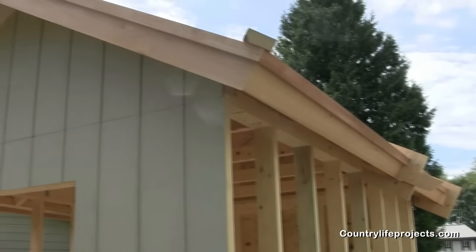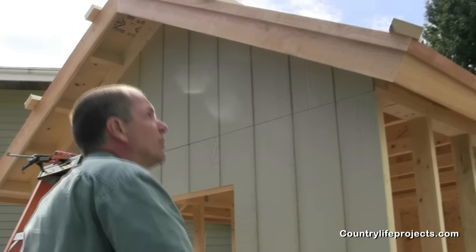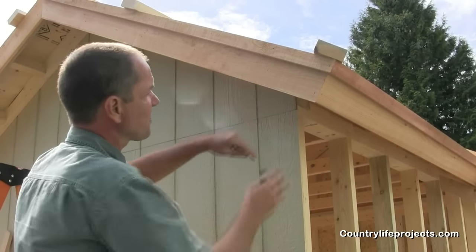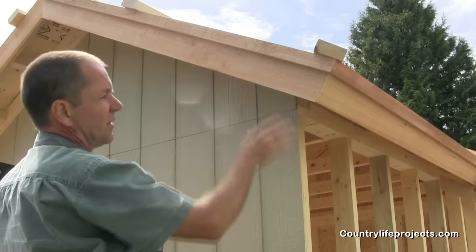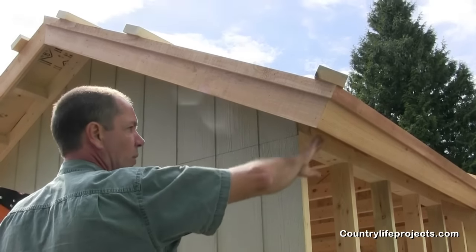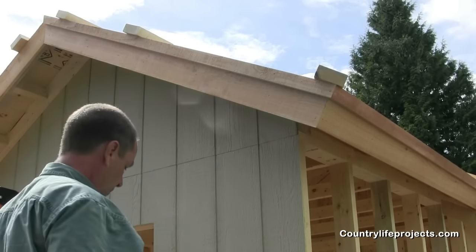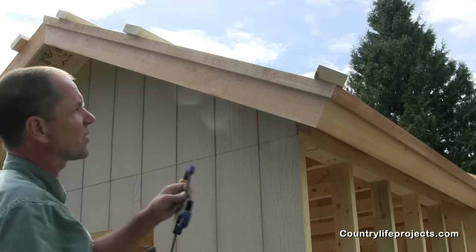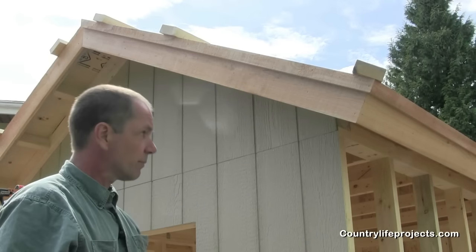When you're ready to paint your fascia board, you'll notice that rough cedar has a few things sticking around — a few frilly bits here and there, or even slivers. Just go around and clean all that up, then paint it. Before we do our soffit material, we want to pre-paint all our fascia board so that when we put our pre-finished soffit material in, we have no painting to do. We'll have a really nice clean line when you look down here.